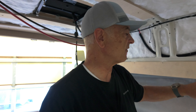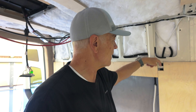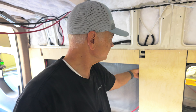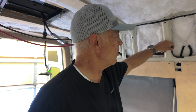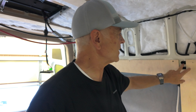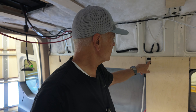I want to show you the way that we do it — there are a couple of different options. One is in your furring strips, you can leave a little space or cut out a notch where you can run a wire over the top and down through. Because we're going to have a capsule here, there's a hollow channel where we'll run all of our wires. We use trim that we can put over these metal edges — this will be in our Google Doc — and then we use wire loom over that so we can pass it over the top and down past the metal. This is the light switch wire for the ceiling lights. That's the first way that we do it.